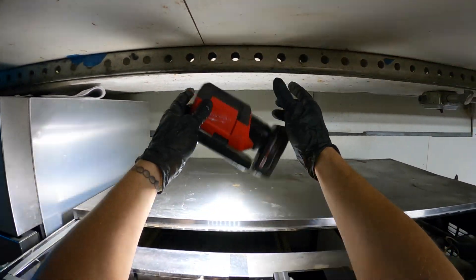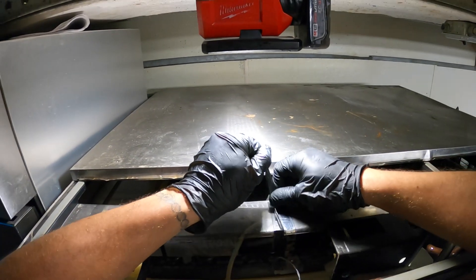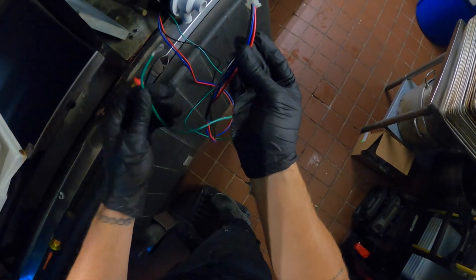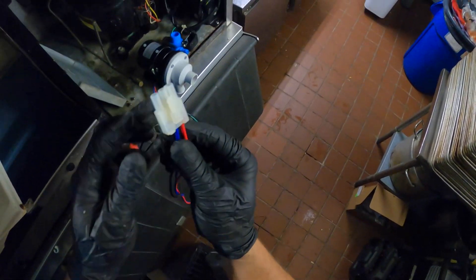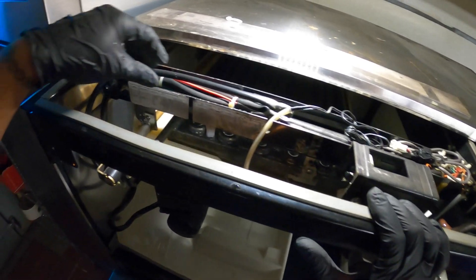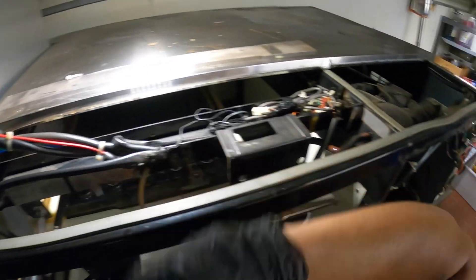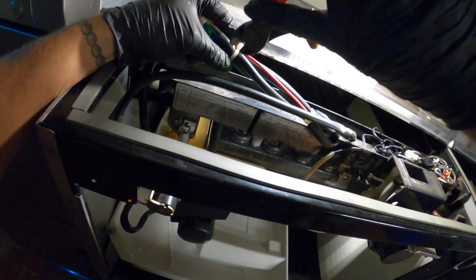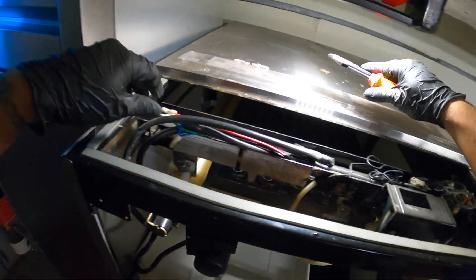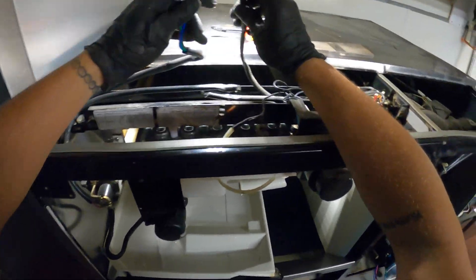It goes up top, so let's push this through and set up our light. This is actually taped up with electrical tape — let's open this up and follow it through to see where our connections are. We have four wires: green wire is the ground, and we have black, blue, and red. There's a connection plug here — this is also used for a couple other models. We've got to get to the connections over here, so we'll most likely just make our connections in this little electrical route area. Let's see — same colors — we're going to make that connection. I also turned off the switch in the back that powers this up.